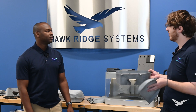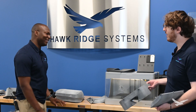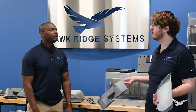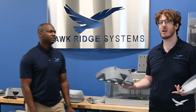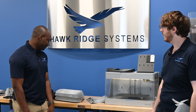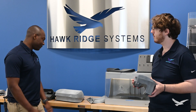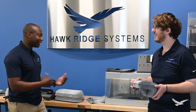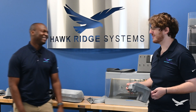In terms of timeline: once we had the 3D scan, it took about a day to fully reverse engineer everything we needed, then about another day and a half for the initial design, and setting up the flow sim only takes a couple of minutes. Within a week's time, we had our initial prints made. By comparison, doing it by hand — going back and forth to the garage measuring and then to SolidWorks — probably took a day just to get the first design, and it didn't even fit. Without the 3D scanner, it would have been multiple iterations of the same part just to get a fit, with all that wasted printed material and downtime.